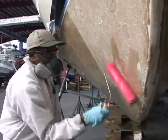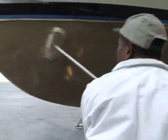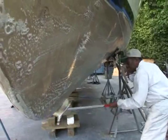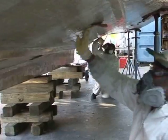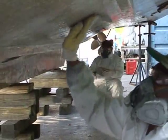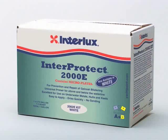Generally, two coats are recommended to properly seal everything up. One of the byproducts of using epoxy resin is something called amine blush — it's harmless and can be easily removed with just soap and water and a scrub brush. Scrub the whole hull down and that should do it. After that, come back with some sandpaper — 60 or 80 grit will do — and take off all the gloss from the HT9000. Once that's done, you can start the application of the actual barrier coat, which is the Interprotect 2000.